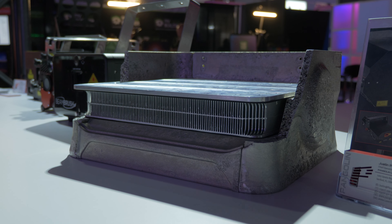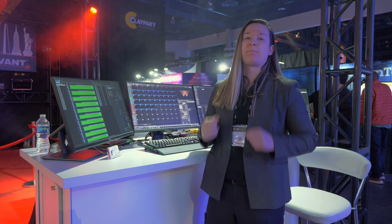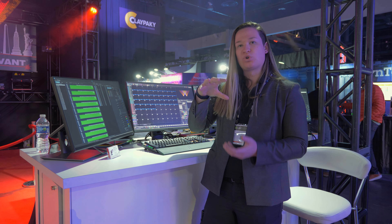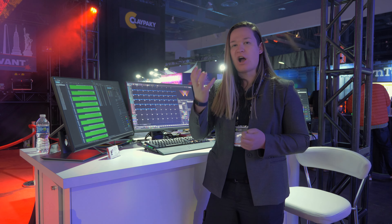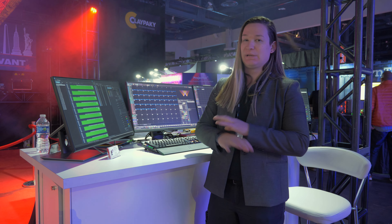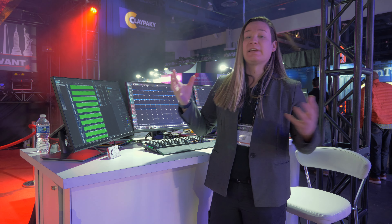The foam aluminum also has benefits if it were to be dropped. Most manufacturers of entertainment products aren't planning for you to drop it and put it back on your show immediately. The foam aluminum has this crush capability — when it does get dropped, it'll actually absorb the energy and crush instead of putting all of that shock and G-forces straight into the optics. This allows the projector to basically be dropped and put back on your show immediately without even teching it. It probably will need alignment, but it's going to stay in your show, which is incredible.